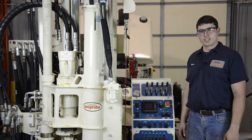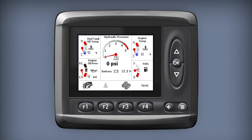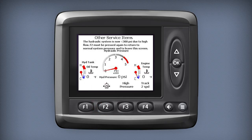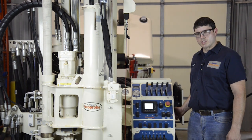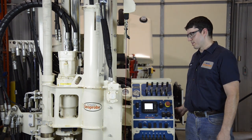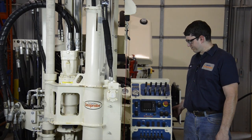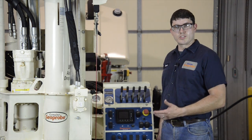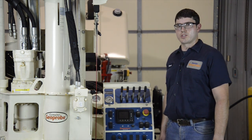Now that I've purged the air from the pump a second time, I'm going to repeat my startup process. I'm going to turn the key to the on position without starting the engine, press F1 under the engine icon, and F2 under Service 1. I'm going to press F2 again to put the machine in a low-pressure, high-flow state and once again start the machine listening for cavitation. If your machine continues to cavitate after the second time, you need to continue this process over and over — it may take six or seven times to purge all the air out of the system.